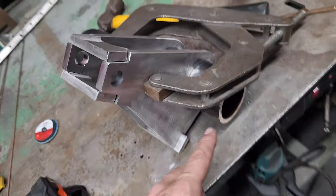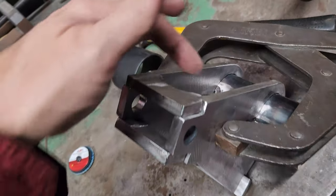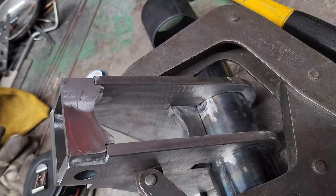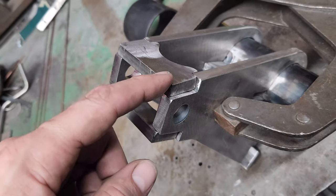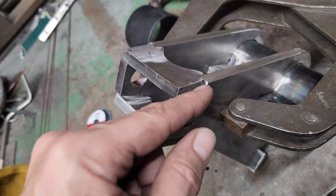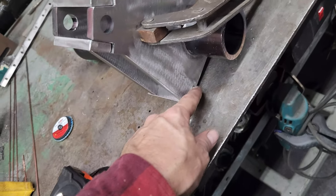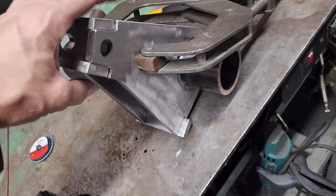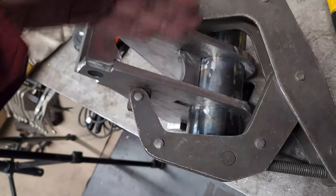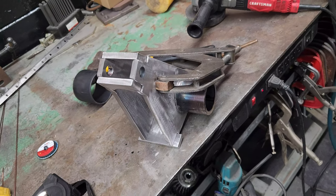Let's take a look at this. This is the torsion housing we made in the last episode, and these are my laser cut pieces — I got them all ground down and all the laser slag ground off the edges, which is very important when TIG welding. This thing has basically jigged itself together. I love doing the notches. I leave these pieces short so I can fill with weld instead of having them flush. Everything tabs in and I'll be able to weld all down around in there.